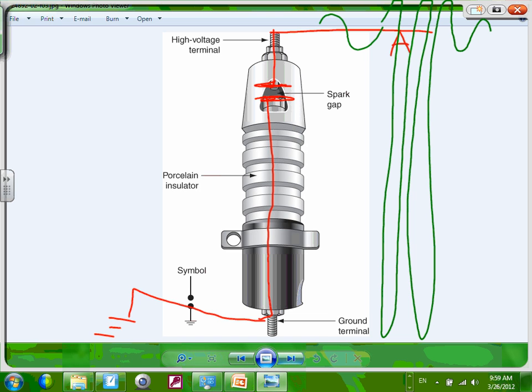And then it goes back again smooth. Can you guys see this is called the transient? You got hit by lightning in this section, right? And then it goes back to normal. The lightning is over. Just that section, because it's high voltage and because of the gap between the phase and the ground, the voltage is so high it will jump. So the voltage will jump here, and it will take all this voltage down to Earth. Who cares? Otherwise your equipment will burn.